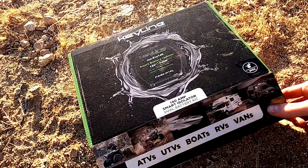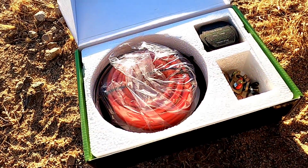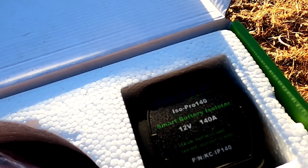When I get back up to the PNW, I don't expect the story to be quite the same — solar isn't quite as strong up there, and it rains a lot. So what I intend to do is install a battery isolator. This is a system that connects your starter battery and your alternator in line with your house battery, so whenever you're running your vehicle, it will charge it right up. A couple hours of driving a week will actually give me more than enough power to get through most of that week. I have a lot of upgrades planned for the future of this power system and the van as a whole. Let me know what you think of my current system and what you think I could improve, or any suggestions or tricks you might have. Thank you all for watching. I've been Glitch. Glitch out.